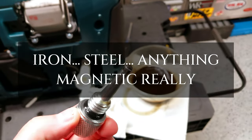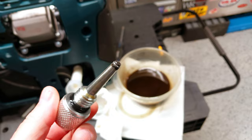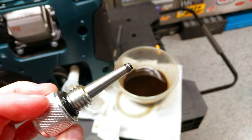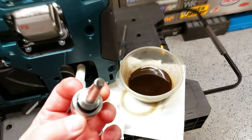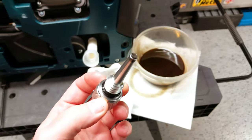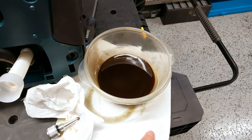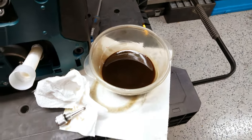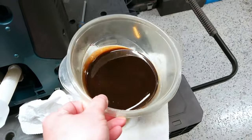And this is the first hour of runtime. That's rather impressive. I think it's probably, for a brand new motor, it's probably about the best I've seen when it comes to metal shavings. The oil, again, nothing to write home about. That was just T4 1540 that I had. It's pretty dark. Like I said, very minimal